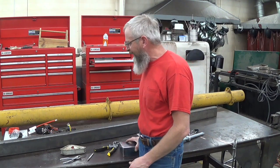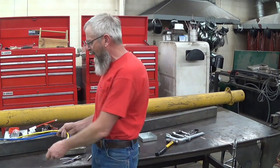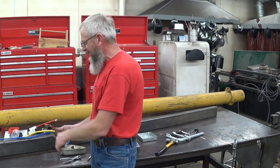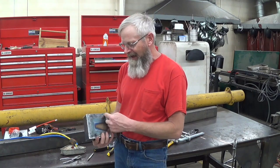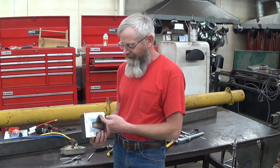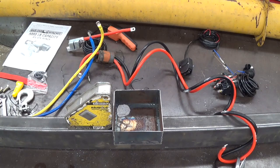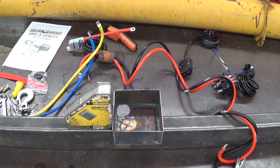I've found an old piece of radiator hose that I'm going to use as the grommet for the cables going through the box. I measured it up — I'm going to need about an inch and a half hole, and I'm going to put it in the bottom of the box, coming up through the bottom. I'll grab the plasma torch and zip a hole in that real quick. I've got my hole cut in the box and it's set up to fasten down, so I'll fire up the wire feed and tack that box right where it belongs.